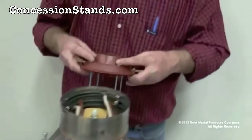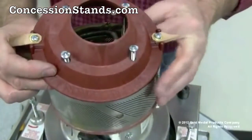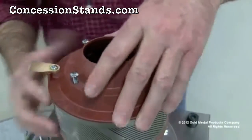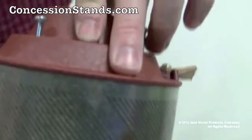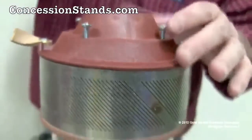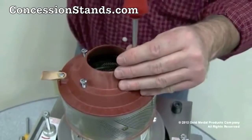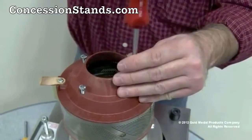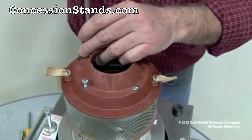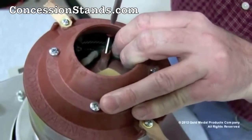Reinstall the spinner cap. The spinner cap also has a lip on it that will engage the top of the band assembly. This part must snap in place — note the fit; it should fit very nicely and concentrically. At this point, start tightening the screws. Do not use a pneumatic or impact screwdriver. Perform this by hand in a criss-cross manner, crossing three to four times to make sure everything is evenly tightened.